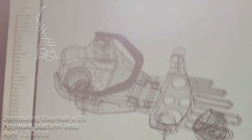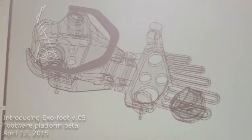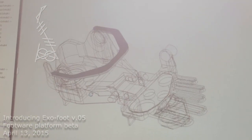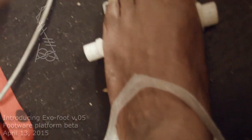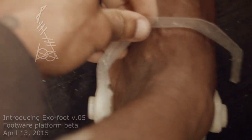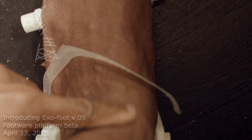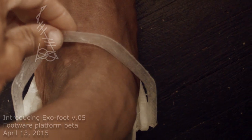I'm playing around with how the ankle brace is going to attach to the design. Right now it's just a piece, but what I do is print that piece since it doesn't take a lot of material, and then I can adjust it. I can see that there's a lot of space on this part here, and that this is going to cut because that's where that tendon is. So now I'll redesign this to take those things into account.